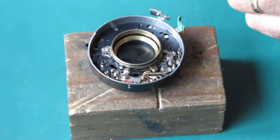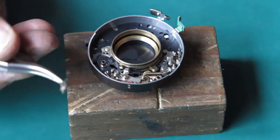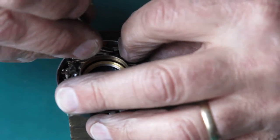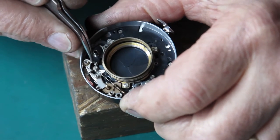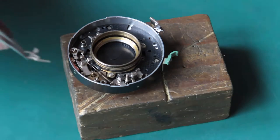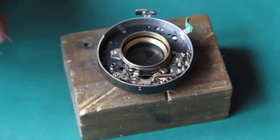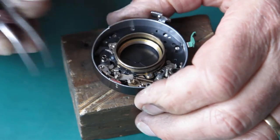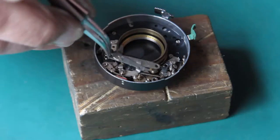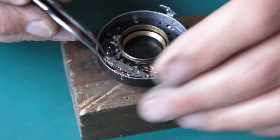Some more of this stuff. I'll just put a wipe of some molybdenum through the center of that piece. It's spring-loaded - swing it around, it latches into position down in here, and I want to get my flash contact in place. The moving flash contact sits on top of that piece. That's seated correctly. If I cock this part, it allows that flash contact to move back out of the way, so it's not in the way of the latch mechanism here, and I can get that seated correctly.